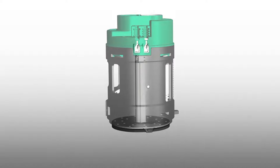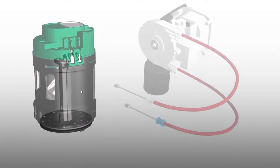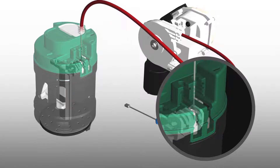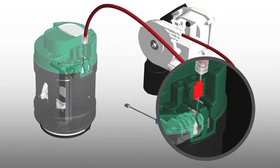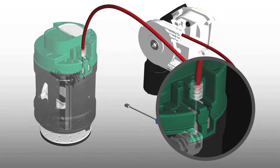Raise the flapper into the valve body. With the flapper raised, insert the cable metal tip with clear sleeve through the right side opening of the valve body and into the flapper hook. When viewed from above, check that the metal tip is inserted fully. Bring the cable upright, then test by moving the cable in an up-down motion to ensure the connection to the flapper. Secure the clear sleeve of the cable into the corresponding notch on the valve body, checking that the clear sleeve goes in all the way.